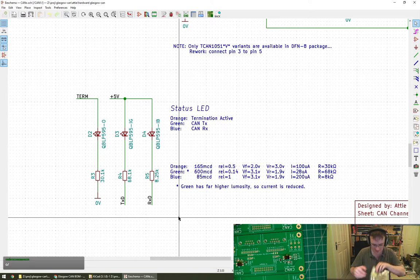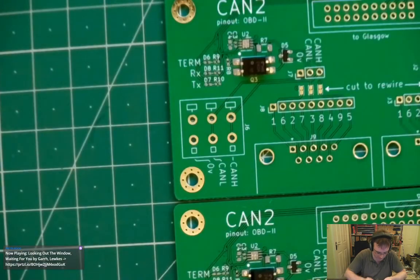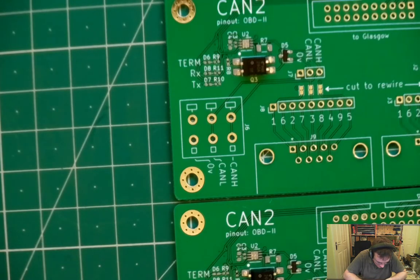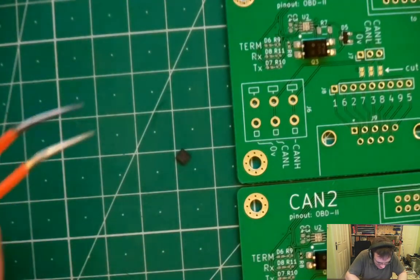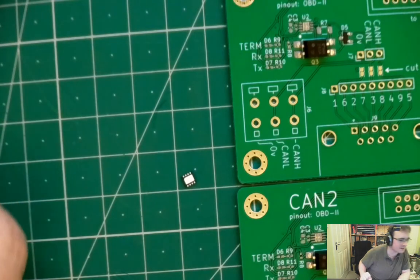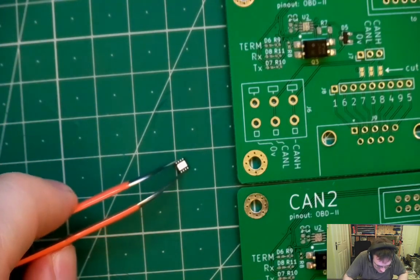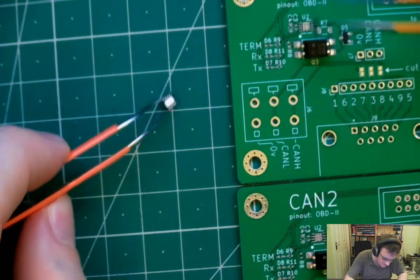This is the CAN transceiver. That's pretty obvious where it is, though orientation might not be right. These CAN transceivers are little doodads like this — very small and square, and on the bottom they've got pads. There we go. Now that gives you the orientation on two out of four axes. The next thing is to see where the spot is on the top of these guys — this is where a good flashlight comes in.